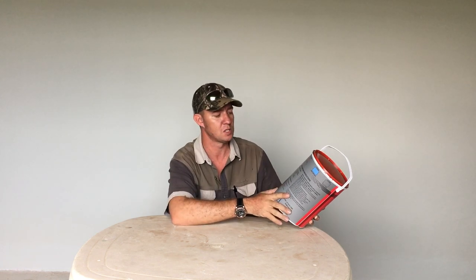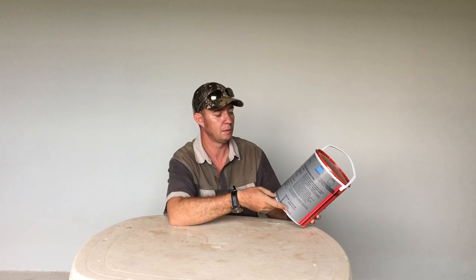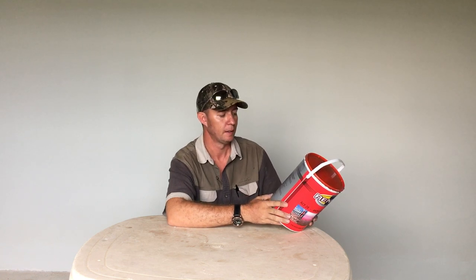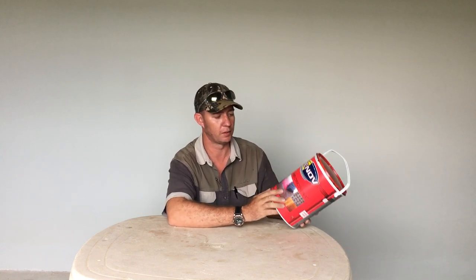Because you've waited 8 hours, there's wind and sometimes rain in between, we do wash the roof again just to get loose stuff off. Birds do come and sit on the roof, so you want a clean surface. I'll add another picture of the first coat application that we've done with this Renoff product. With one coat you can't even scratch it with a steel brush — it really adheres to surfaces very well. I've been working with it for about 4 years and haven't had any issues, comebacks, or anything with it.